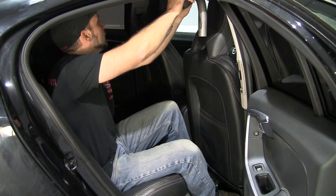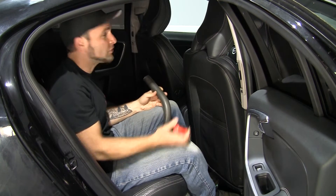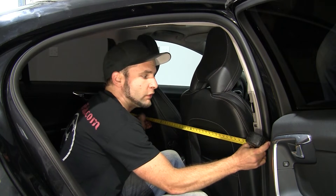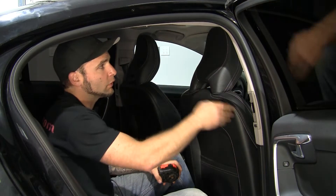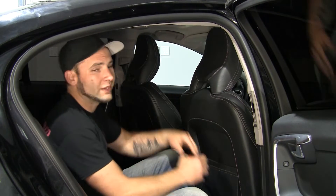I'm going to set this up near the headliner here — looks like 14 and a half inches. So we're going to do 29 inches of straight tubing across the top of the car. From body to body I've got 53 inches, and these two corners up here we're going to bend once at the headliner and then once down at the shoulder. Those are going to total 90 degrees.